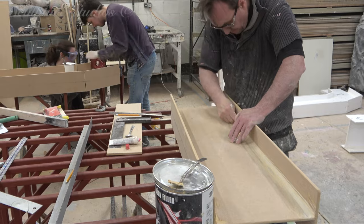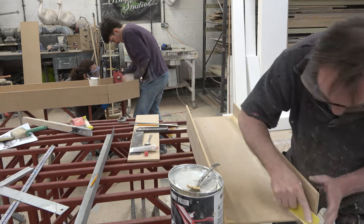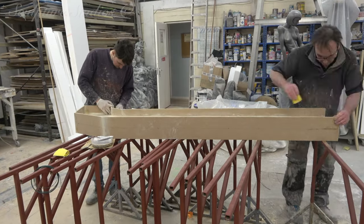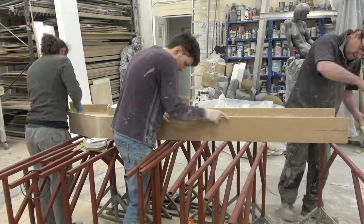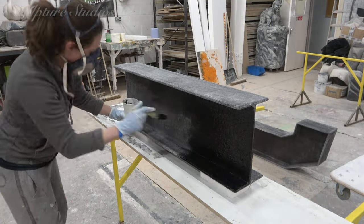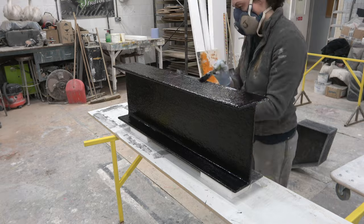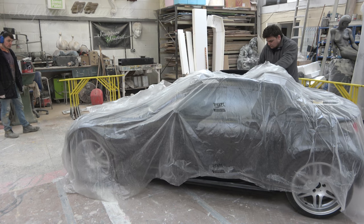It's a fine line when blanket coated with fibreglass, but for something like this that doesn't require too much detail, this should be a perfect method. Once everything has been prepped and the fibreglass has been applied nice and neat with a general purpose resin, we then go over with a black resin flow coat. Not only does this help soften that obvious fibreglass matte texture that won't really be appropriate to look like steel, but it also produces a good base colour for the eventual artwork.